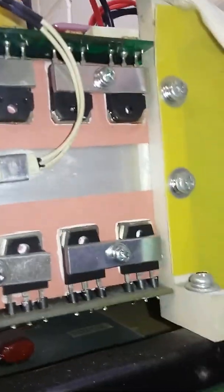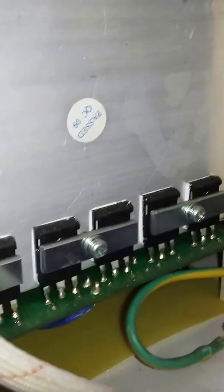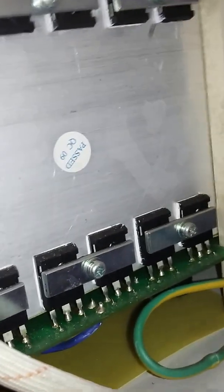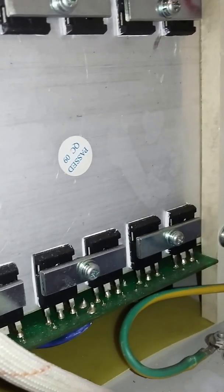That small switching transformer looks to me to be driving the electronics on the board. Up here they're using an H-bridge of MOSFETs to drive the main switching transformer. There are two output filter chokes to filter the high frequency, and then it passes into another H-bridge made of IRFP260s.